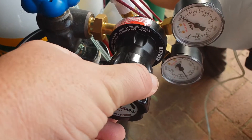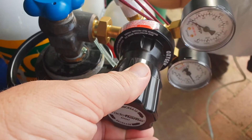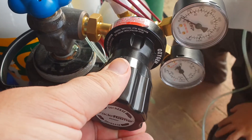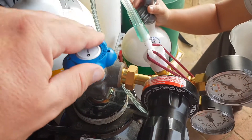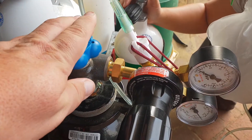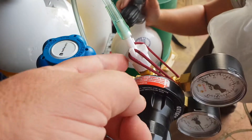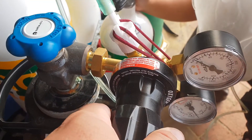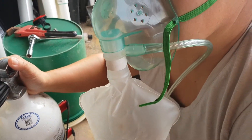With the welding regulator, I've got very, very precise control over how much oxygen flow I have — much more than the other version. If we run out of welding regulators, we can go straight to the other oxy side, which goes in here. But coming off the low-pressure hose like this, we have very, very precise control. You can hear it flowing now.